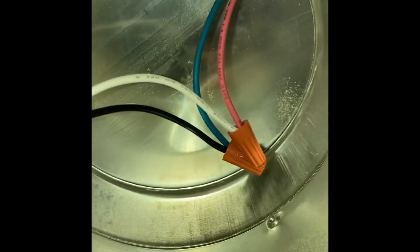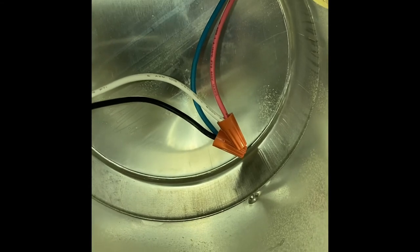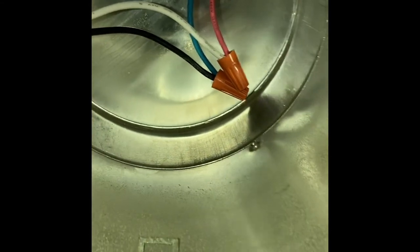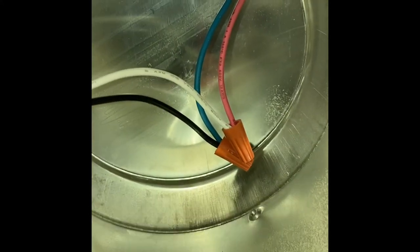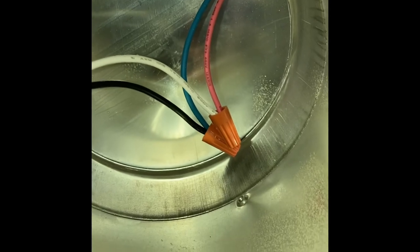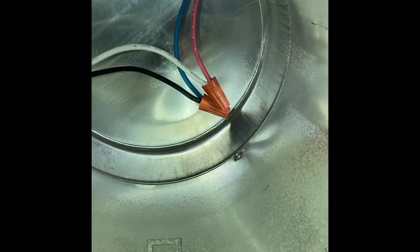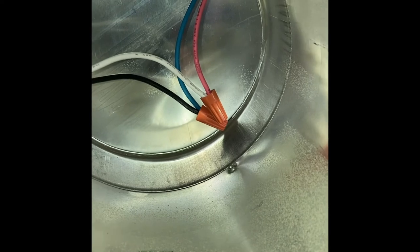All right, so inside the can, I got my 2 wires there that we modified from the original system, and then I use these little wire nuts for these because LEDs are super efficient. They use very little wattage, so these wires are like 18 gauge, I want to say, and these little smaller wire nuts work great. And these are some of the ones that I recycled that were originally for the ballast wiring inside the ballast box that we cut all off that we don't need anymore.